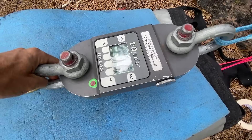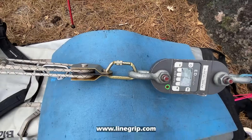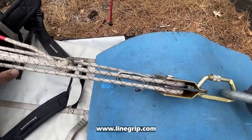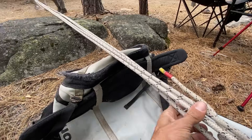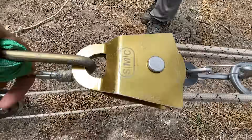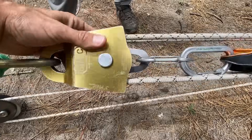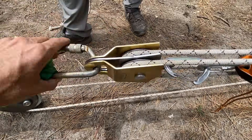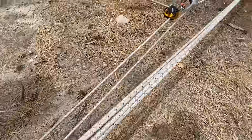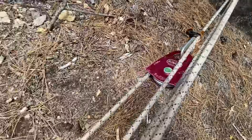We just broke a line scale, so we're a little afraid to use our second one. We only have two, and if you guys buy line scales from linegrip.com, I won't have any to buy. He is running low but he is ordering more. Anyways, it is the preferred one to use in this case. So what we have here is an SMC pulley — these are 45 kilonewtons, which is probably where they'd break — and so we can use them on tests that are less than 45 kilonewtons. Gregory in the brake, got our multiplier here. Actually it's a 27 to 1 because he's multiplied it again.